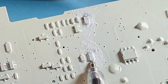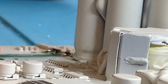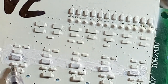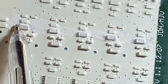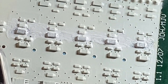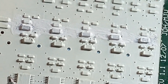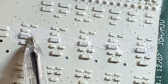So if you have a GPX of the vintage that has those pins, and you think your detector never behaves properly or not as good as other detectors, what I would do is take one of these capacitors off. If you have a look at the placement, that one, that one, that one, that one, take one off. Solder a couple of very, very small wires to it and stick it in an accurate capacitance meter, not a bodgy one, but something that can measure down to picofarads, and see if they measure around 18 nanofarads. If they measure that value, they are the correct ones. Just solder it back on.